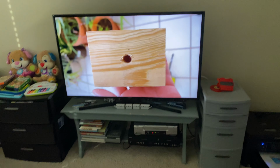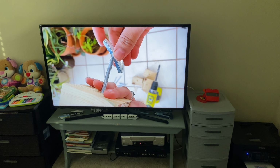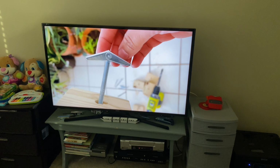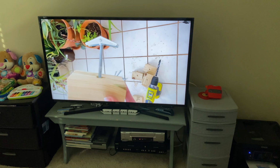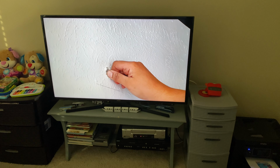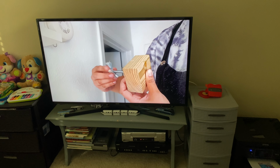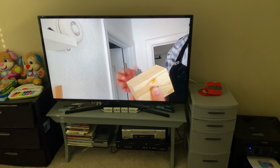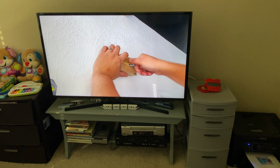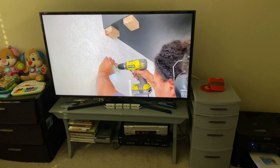Okay, for my side that doesn't have a stud, I've made a bigger hole in the block, and I have this toggle bolt. I go in there, and then this end, the fastener goes on it. And basically when I put it into the wall, it's going to tighten and get a really secure fit. Okay, so now I'm holding it and I know it fits. A lot of air in there. I fastened the bolt on not too far so it could still fit into the wall. Once you start screwing it, if you put some pressure from the block, it will then secure it right in.